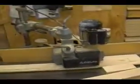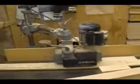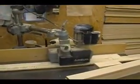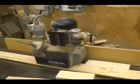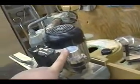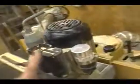I've had this power feed since, boy, I was in high school yet. I was like a junior. Now I feel old. Back in 1994, I think. So this power feed's 18 years old. It had a couple little things that have gone wrong with it. Originally, the capacitor burned out. Now I've got a capacitor on the outside here. There's nothing inside here except for a switch.